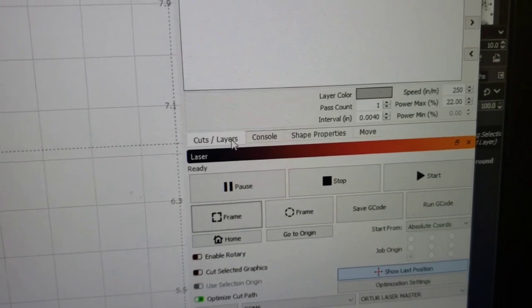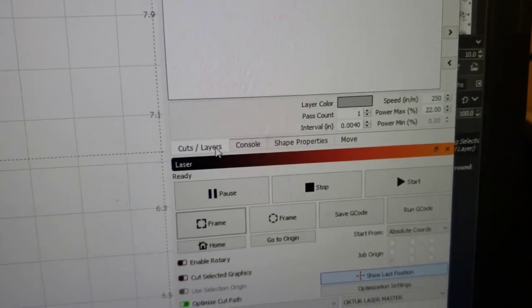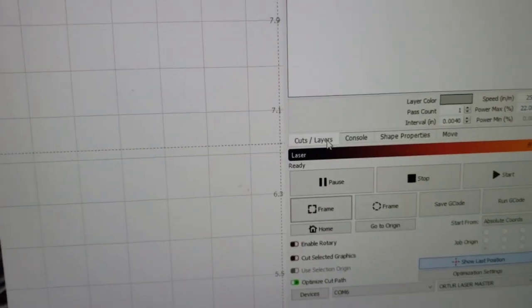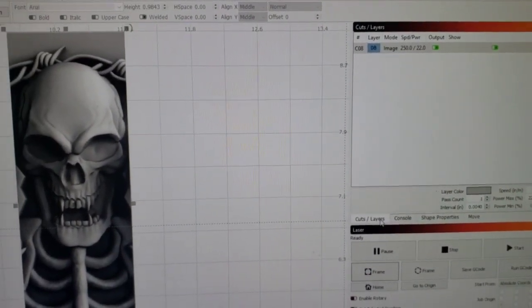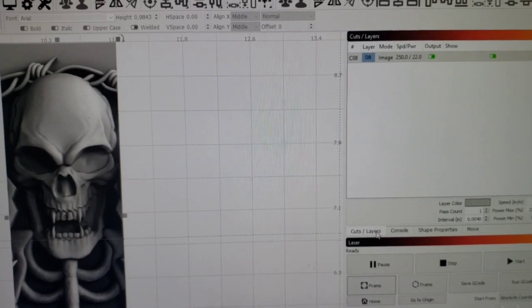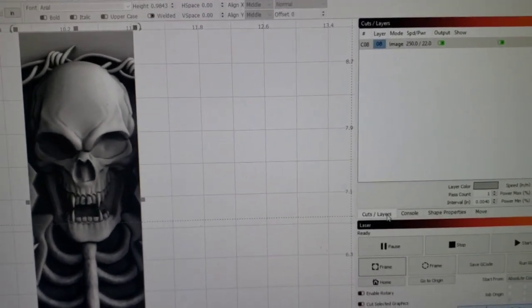The resolution is set at 250 DPI with the native resolution at 500 DPI. As I've said in previous videos, I find that setting the native to 500 and running light burn at 250 seems to help darken up the image — it's basically putting double the newsprint dither per pass and it does burn darker. I'll be running all test patterns at these settings, though it's probably going to be too dark for just the bare 50/50 — normally I'd cut that back to about 18% — but we're going to run them all the same.